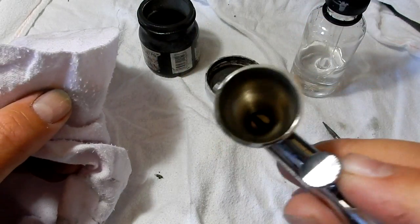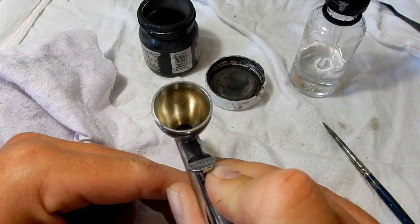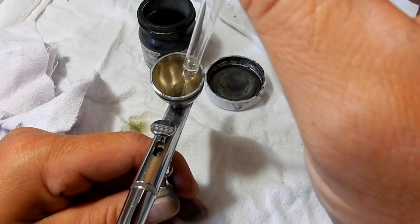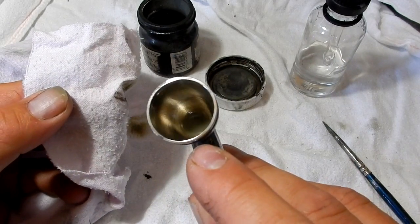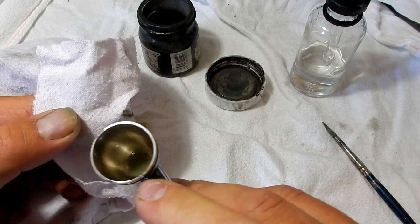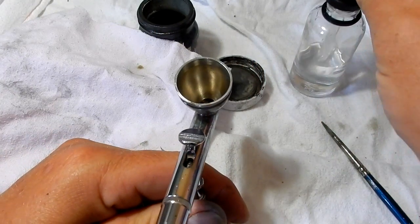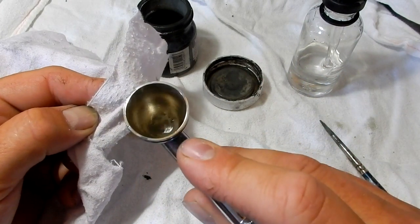We'll tip that out again — it's starting to look clean. You can use your rag with your finger just to wipe out a bit of the excess, but you'll find there's still a little bit left. If I spray this now we've still got paint in there, so we're going to repeat the process again — not as much thinner this time. You can see it's still coming up murky, so keep repeating. That just loosens the paint off. Not as much coming out now, so we'll repeat again, and keep doing this just until all that color is gone.